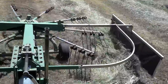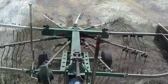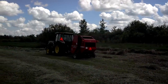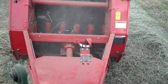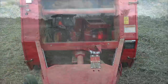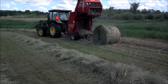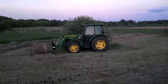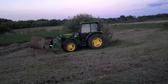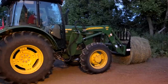This thing's got a wheelbase of about 85 inches, so it's a nice row crop tractor in that regard. The steering is hydrostatic, and the brakes are independent wet disc brakes which are really nice. The final drive on this is planetary. Here we got it on the little Massey Ferguson baler out baling first crop — it just toys with this little baler. The PTO is 65 horses, which is way more than this little baler needs. We'll put it on the bigger John Deere baler for second crop. The engine's 83 horses coming out of this beast — plenty of power to do what we want. That's one of the first end-row bales — a little scruffy but this tractor has absolutely no problem with it. Really enjoyed working with this tractor on first crop. It's very comfortable. This is my wife driving now — she's learning how to fork bales with the spear. She maybe forked that one a little high but she improves as the day goes on. Bringing them into the yard and into the barn — pretty easy to do with this tractor.